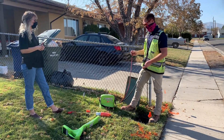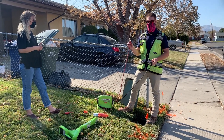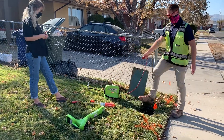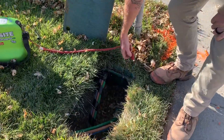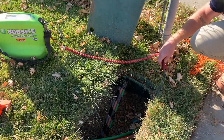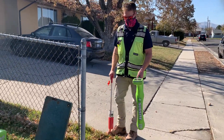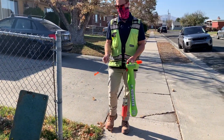What you have to do is get one lead in the ground, and then one lead on the metallic object. So I'll put this on our ground here, and then turn on our transmitter to a frequency, and then hook it up right here to our tracer — it's a little tiny tracer — and then it'll light it up. You can hear that sound is where the tracer is actually at, so we'll know that our conduit's right there.